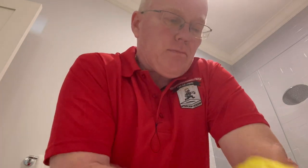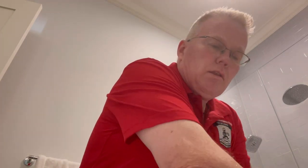Now, don't be offended. This is not for amateurs, because there's a lot to go over that I don't have the time to go over. If you're going to make a cut on a patterned wallpaper, you have to cut around the lines of the pattern so as to hide your splice. Secondly, you have to use the thinnest blade available, which is a single edge. And it's a little dangerous, you know? So this is not the first time you want to be doing this. You want to have some seam cuts under your belt before you attempt this.